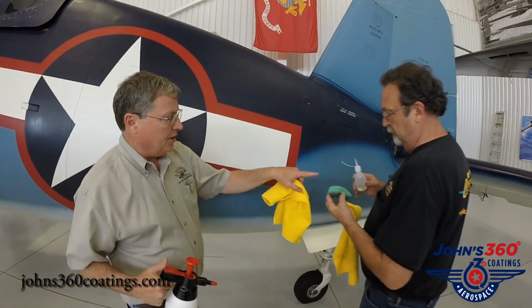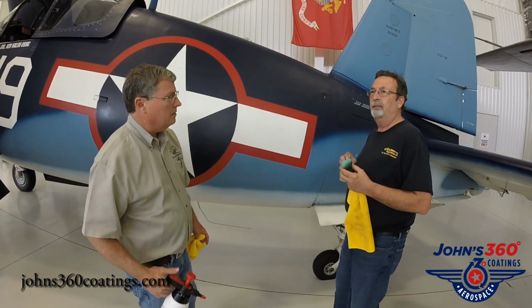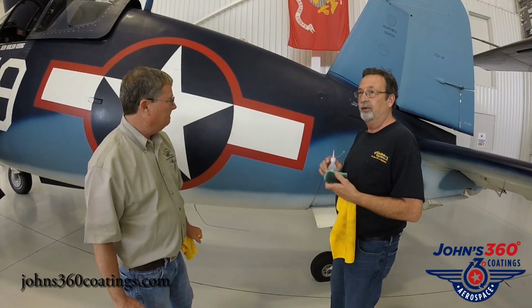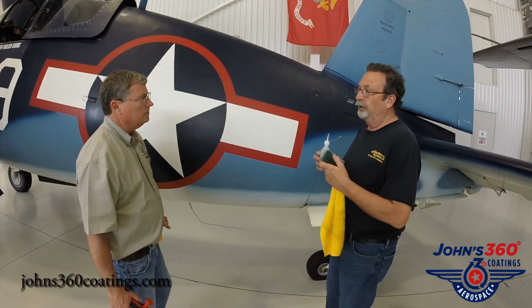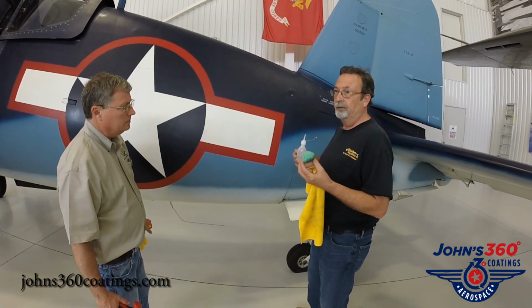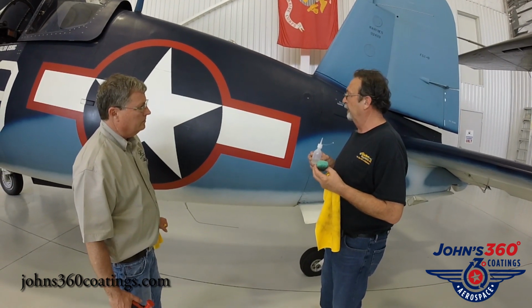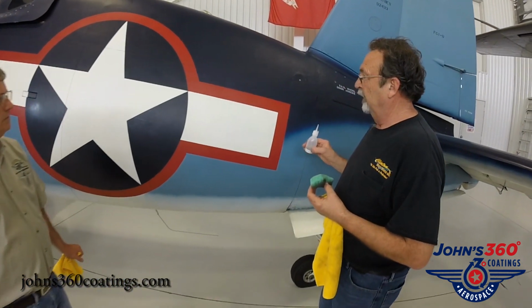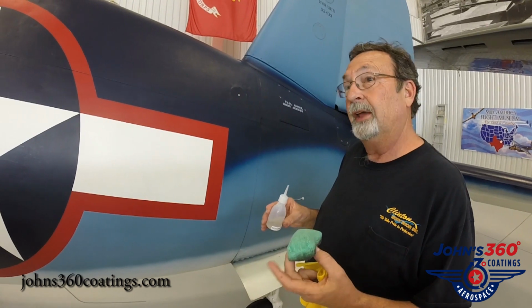You've already mixed your A and B in this. This is the exact same formula we used on the polished airplane. It's the same formula that you would use on a painted surface, and all it is is equal parts of A and B. Put it in here, shake it up good, and you're going to do the same process that we showed earlier: about 8 to 10 drops on this sponge at a time, and we're going to do about a 2 square foot area. And you're going to see that it's not going to make this matte finish nice and shiny or anything like it would on a painted surface.